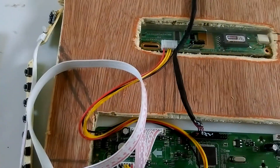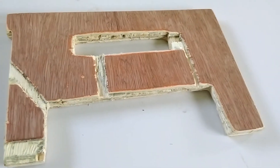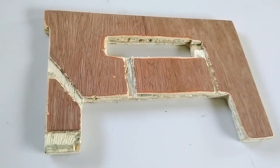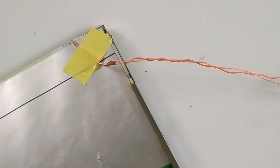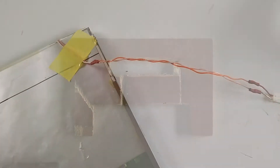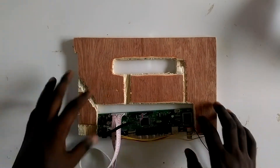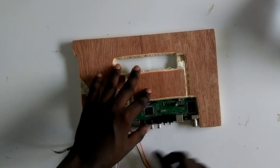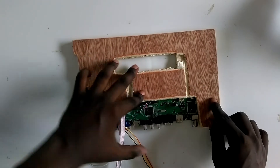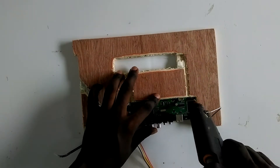Nothing a little sanding couldn't fix. Next, I marked out and chiseled all the cable channels — not all the way through, just deep enough to allow the cables to lie flush with the surface of the plywood. I also extended the cable to the LCD's lamp to help with routing. I then proceeded to attaching the boards to the plywood — hot glue is perfect for this as it holds well to both wood and PCB. I placed the plywood on a flat surface before sliding the board in place, ensuring the PCB is flush with the bottom surface.